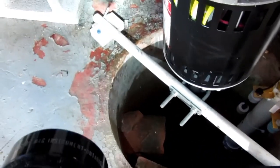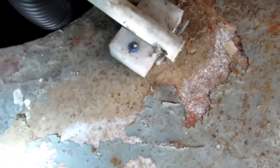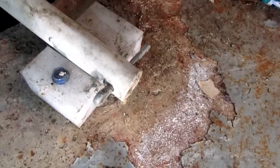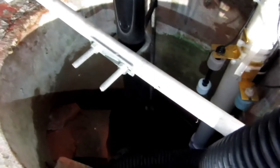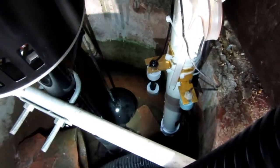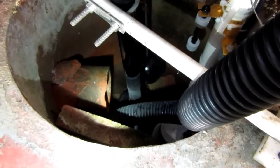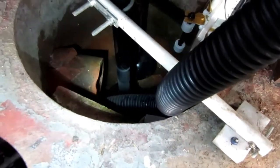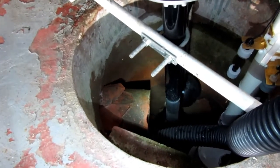You may notice I've got this piece of PVC pipe here, which sits on a couple of nylon or Delrin pillow blocks stuck with a Tapcon into the floor. There's a sort of cotter pin and then a U-bolt goes around there. I had cases where the pedestal pump walked sideways over time, and the float doesn't have a lot of clearance down there — it would touch the side of the pit and drag, and then it wouldn't turn on. I had some flooding a couple times due to that, or the whole pedestal would tip over. So I put this in, and that helped a lot. I'd recommend anybody with a pedestal pump do that because they are top-heavy, and there's really not that much keeping them from tipping over or walking around.